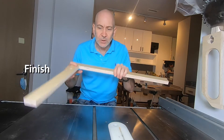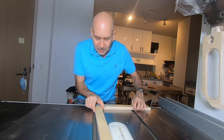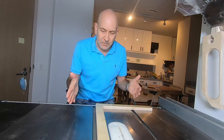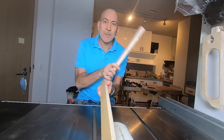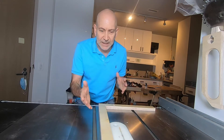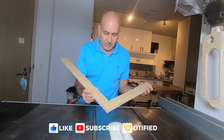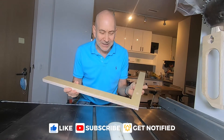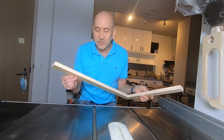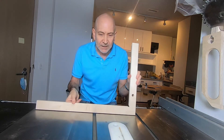I recommend using the flip method with a nice stable back to get a good right angle on your plywood square. There are two methods to dialing in the angle: you can either do it on the table saw and then go back to the bench and make adjustments with the plane, or just do it with a rig and use the flip method, which I like better. You can get good feedback quickly and make changes right there with the plane. It only takes a few minutes to adjust your one-dollar square into a very useful tool for setting fences and other jobs around the shop where you need a perfect 90-degree dead-flat square.